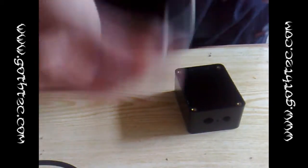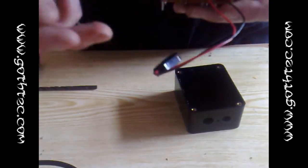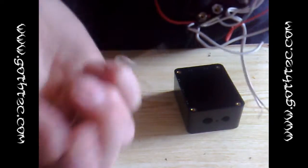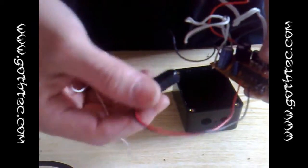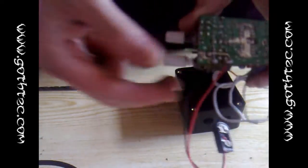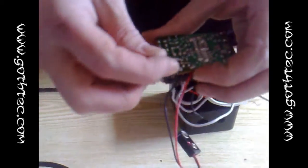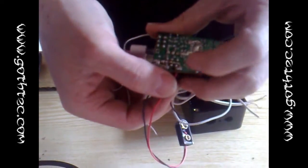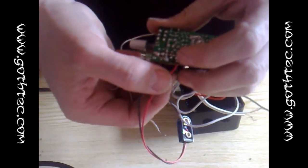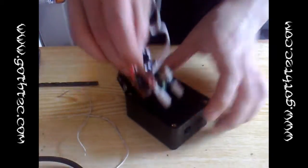There were two power wires — I knew which one was which, there was an AC1 and AC2, one in and one out for the switch. What I've done is removed the original cables and replaced them with the nine volt battery connector. I heated the soldering iron on top, pulled the wire as the solder released, then heated the solder again and pushed the new wire back into place.